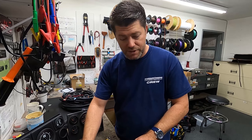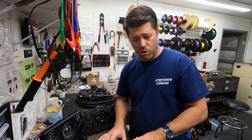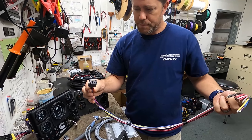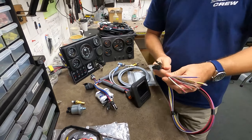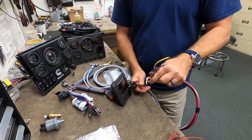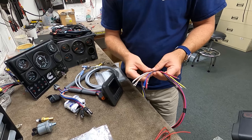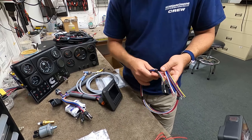On both the Cummins OEM panel and the SMX panel, that same connection is there. So out of the box, the SMX Digital View is ready to connect to either a 6B series or 6C series Cummins engine. But if you have a Caterpillar, Yanmar, Lugger, or some other mechanical engine, this system will still work. What we typically do for customers with those engines is provide a short female pigtail harness that connects into the male of the Digital View harness, allowing you to splice-connect the main critical wires into your existing system. There are four wires dedicated for power, and all the rest are signal inputs for analog parameters including engine oil pressure, coolant temperature, boost pressure, and all the other options mentioned.